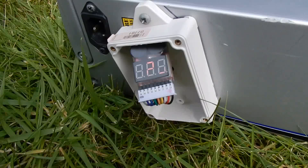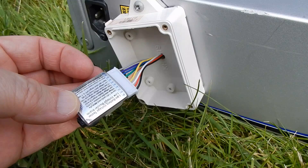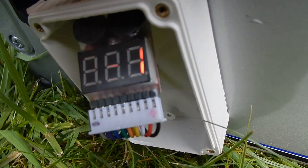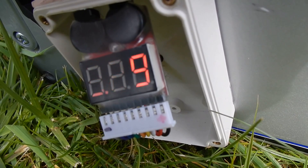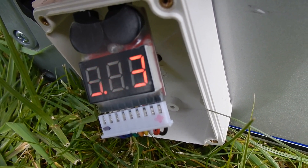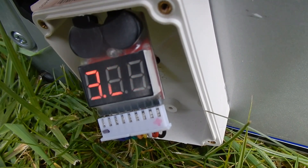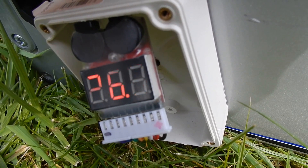I've just put the cell monitor on here. This is an 8-way LiPo cell monitor. It works for LiFe as well because you can set the low voltage alarm value. Let's look at the values — all 26.5V total. Number one is 3.29, number two is 3.29, number three 3.33, number four 3.23, and 3.32. I'm not sure I believe these — I'm not sure this is terribly accurate. If I get this on the Turnigy charger, I can double-check these figures.